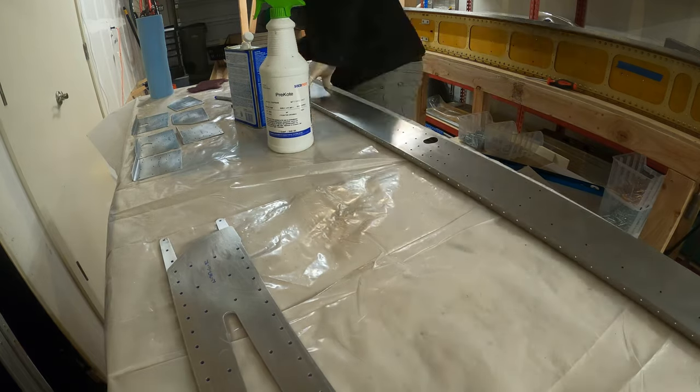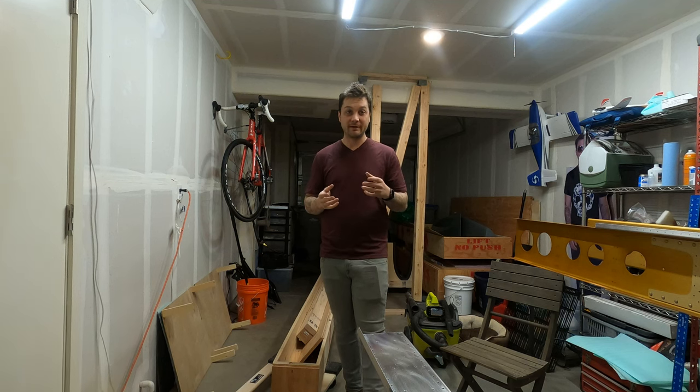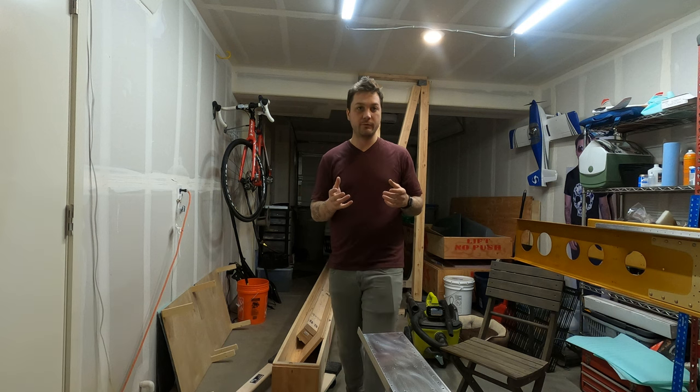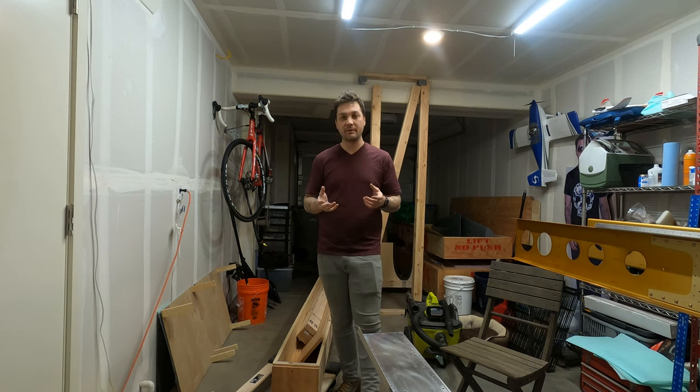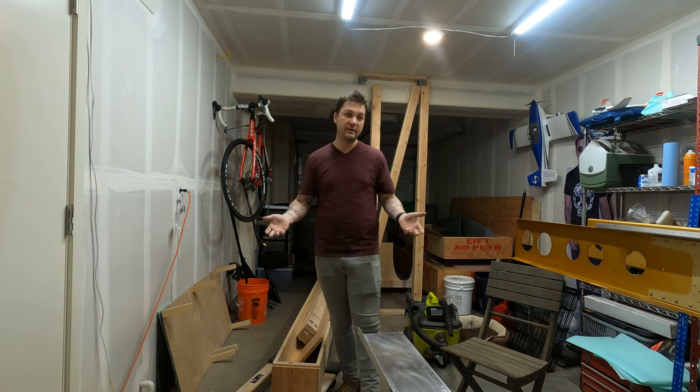And so when I'm replacing that, I only wrote the part number because I'm pretty confident that, assuming I know which one's right and left, I'll know which is up and down. The reason is you'll see that through the primer, and if it's a part that's not going to get final painted, there's a chance that you'll see all your notes written on there if you're looking through an access hatch or on the interior of the plane. So I'm trying to keep part numbers nondescript at this stage.